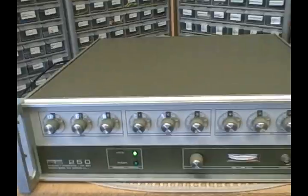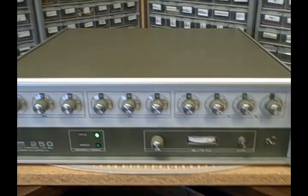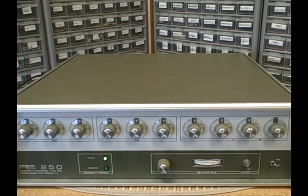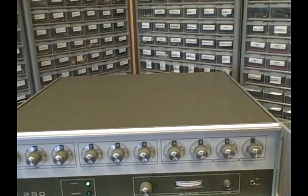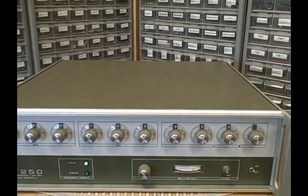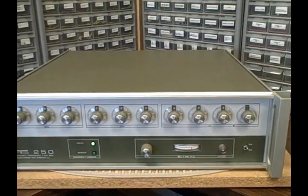So there you have it — a really beautiful frequency-addressable unit, very quick to respond, easy to understand, with a nice clean output. It would make a really fine frequency source for RF on your bench for anything from about 700,000 Hz up to 250 MHz in one hertz steps. Pretty darn good. Happy bidding folks, and we'll see you again.